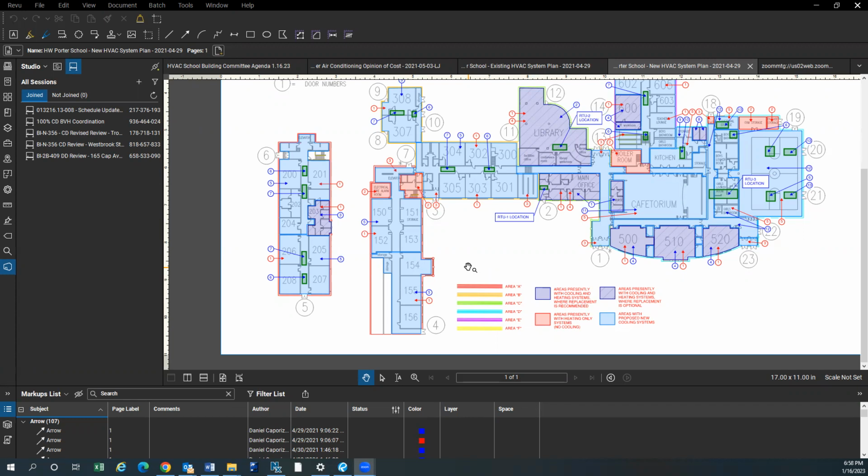It sounds like Larry thinks that what they've come up with is probably the best option. And it may be, but I would be very clear, Mike, if you're writing it, as to the designer what the goal is. If that goal is dehumidification, because we are concerned, especially on the lower floor, with humidity, keep in mind that a lot of VRFs and standard mini split systems do have dehumidification settings, even when they're not in cooling mode. Combined with the ERVs, you can get your air changes, dehumidification, and then the cooling. But I think you have to write that up and have a designer go for it.